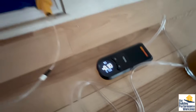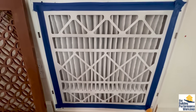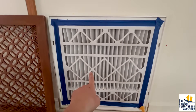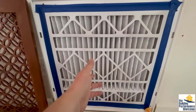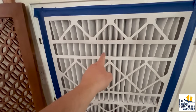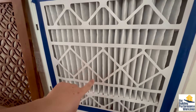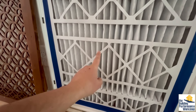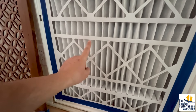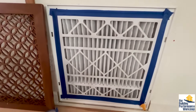Our static pressure is still looking great. Again, it's clean and it will get more restricted when it's dirty. Is this a little bit of a pain? Yeah, it doesn't fit perfectly, but no worries — it's not plug and play for me. But the fact that there is a 3-inch filter available that fits into a 1-inch slot, and the fact that they have static pressure and airflow information — that's the sweet spot. So yeah, I'd still recommend it.